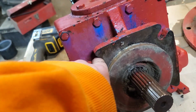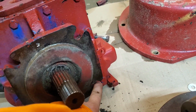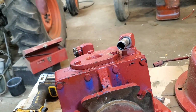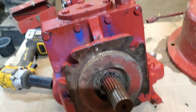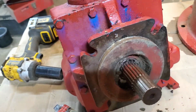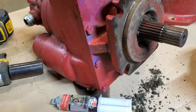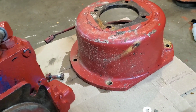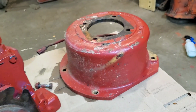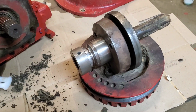We're going to JB weld the bolts that hold this into there because two of these bolts you can't reach from the top of the machine where you have to work on this from, and this is like 9 feet off the ground, so there's really not a way to get up underneath and put the bolts in. You can't get your fingers there because there's other stuff in the way. You can get a wrench to them, but that's it. We're going to JB weld the bolts to that so they can't fall out while we're trying to assemble it. That's our little solution there.